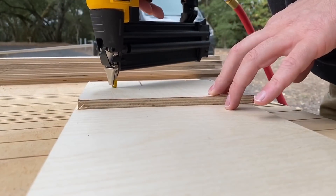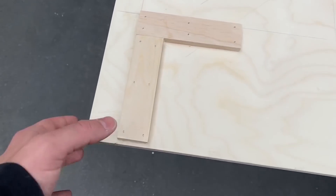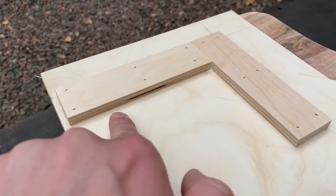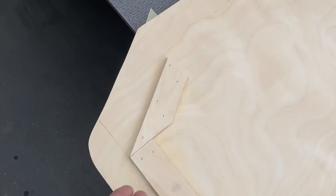The second we got our whole work set up for a nice long day of work, it starts raining. But they listened — we're back in business. This right here is a completed floorboard. We have the supports underneath: I put a little wood glue on the underside of these and then Brad nailed them in. I am so stoked — we just laid the floor in for the first time completely.